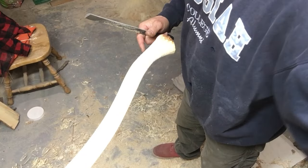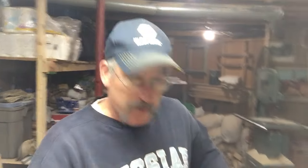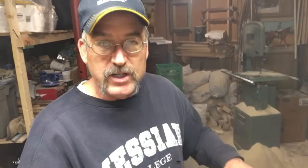There are lots of deep gouges here at this end that the sure-form makes — I want to focus on those. A little trick from the East Coast Lumberjack: if this handle is a working handle, sometimes I'll leave those striations, those gouge marks, in the palm swell so you have a good grip. Otherwise you make it smooth and all of a sudden your hand slides down. On a lot of my racing axe handles, I'll leave the palm swell unfinished because the guys want a grip at the bottom. If it's a wall hanger or a vintage axe you're fixing up nicely, then I'll smooth it all out.